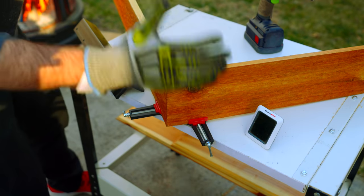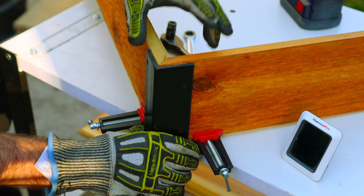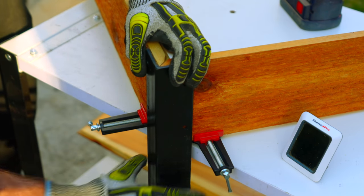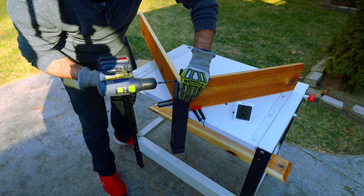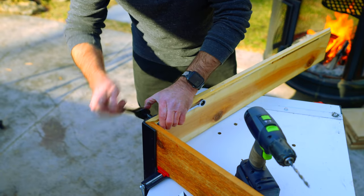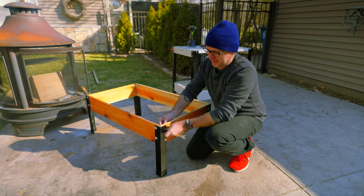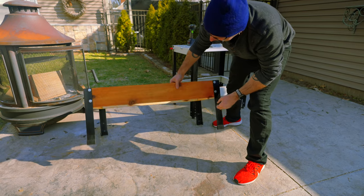I want to keep this project as simple as possible. Under normal circumstances I would probably pocket-hole these together, but I'm just going to attach them to the legs. I'll hold this up, drill my four holes, and put nuts and bolts through there — that is going to be our table base. This is starting to look good. It's also slightly warmer than yesterday by two degrees. We got one corner done. There's a slight gap in the top there, but I'm not worried about gaps — this isn't fine woodworking, this is a DIY project. Now we're just going to do the next corner and repeat, and that is a table. Somehow it's level and it doesn't wobble — that's awesome.